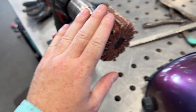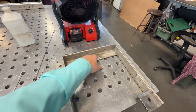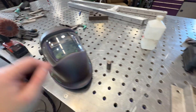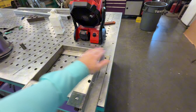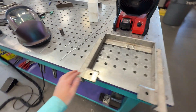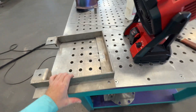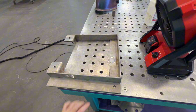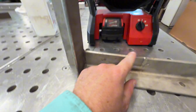I'm going to use a 60 grit flap disc on a grinder, grind it down almost all the way flush, then go over it with a non-woven wheel. Then maybe a hand scotch brite pad after. I can also oakite it for them — make it passivated — but I don't think it needs it since it's probably going to be buried in a pit somewhere. Okay, all cooled down, we're going to start grinding.